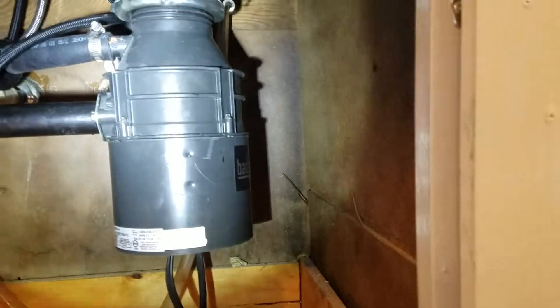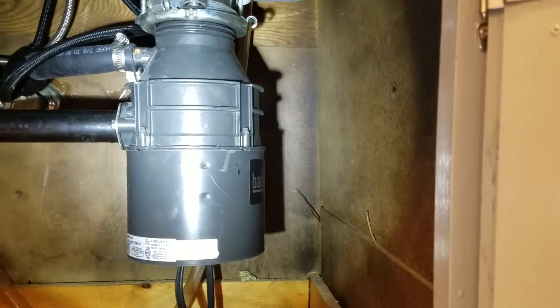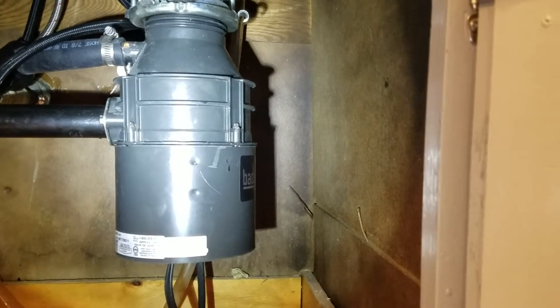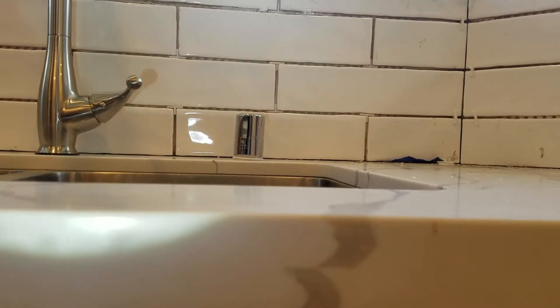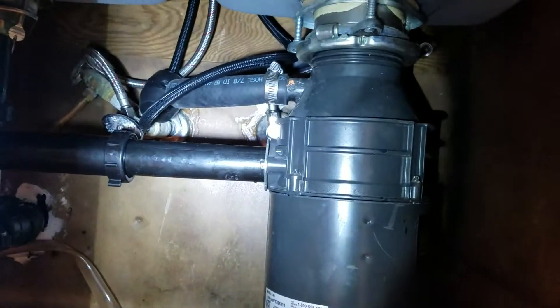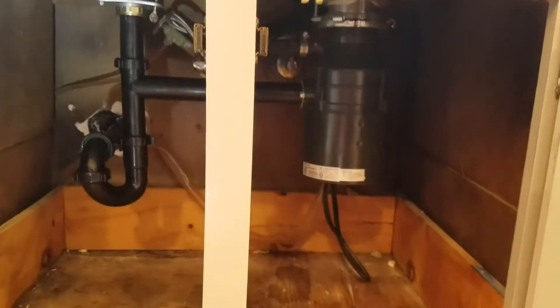The garbage disposal is plugged back in. It was full of tile — they had broken tile and mortar that broke off, so we took it apart and cleaned it out. Hopefully when we turn it on it'll spin free with not too much debris left in there. We also gave you a new air gap. The temporary hose coming off the dishwasher is tied into a 5/8 clear hose, and we gave you a new 7/8 discharge hose running over to the garbage disposal. This installation is done and good.